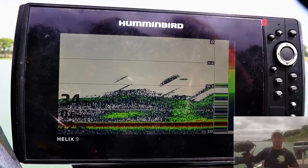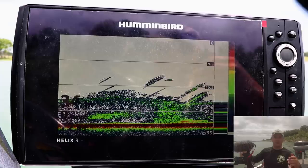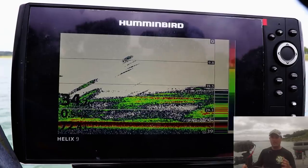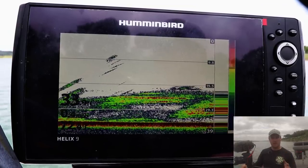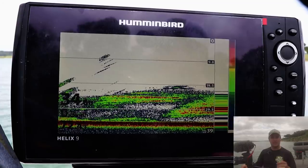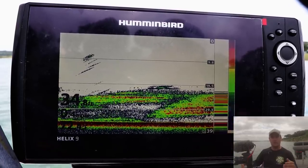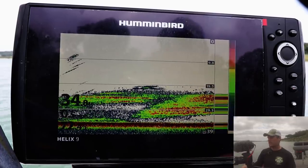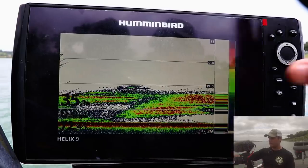If you're sitting at your console and you have your trolling motor in the water, that trolling motor is going to pick up the fish before it actually passes underneath where you're sitting. You could also mount it on the side of a kayak. It's really important to understand where your signal is being sent from — to know if the fish is directly below you, or if it's behind you by the time you see it displayed on your screen.